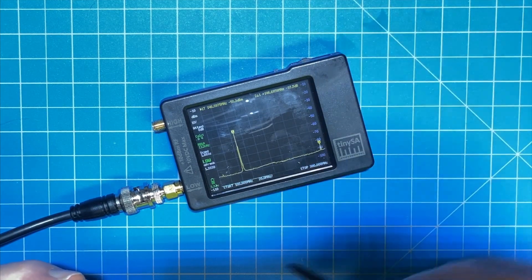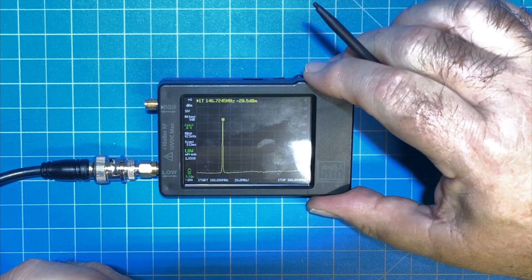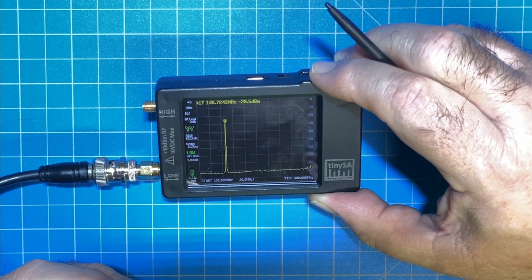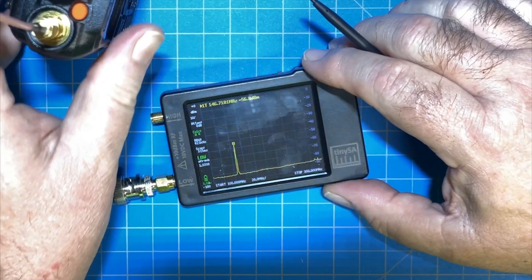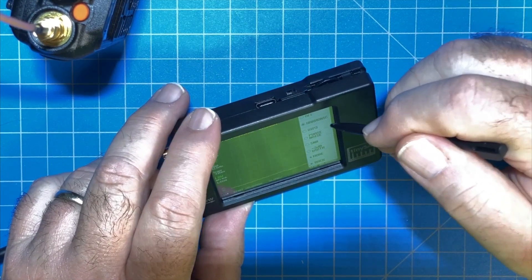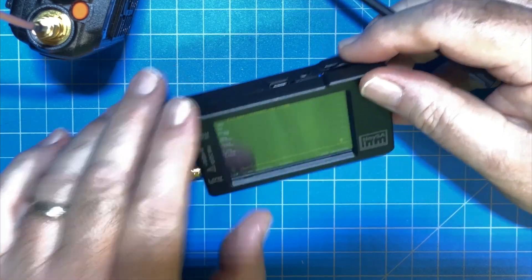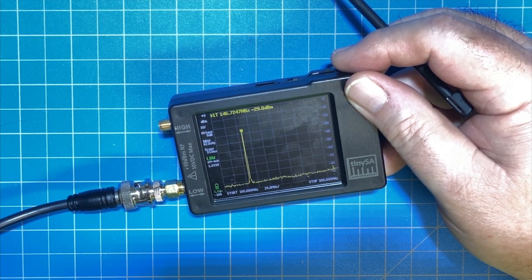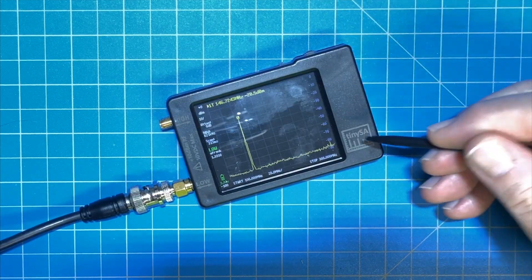I've got a little bit of a shorter range — we're starting at 100 MHz and going to 300. Here we go on the smaller range, 100 to 300, and there's almost nothing visible there at all. Now if we change our measurement — where this says Measure Harmonic, we're going to turn that off. Now the SA is just sweeping from 100 to 300. Let's key up. Since it's not even looking for a harmonic, there's really nothing even visible.